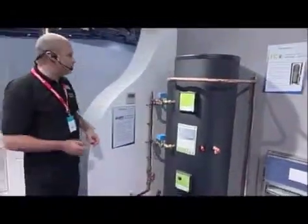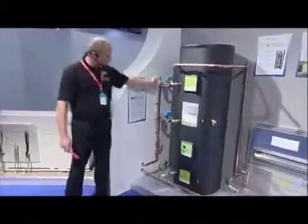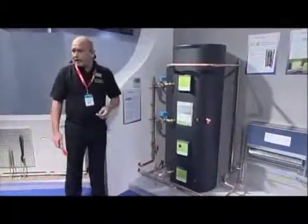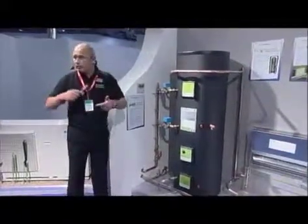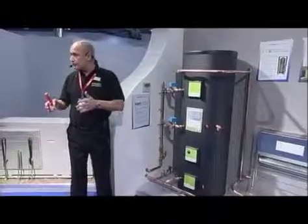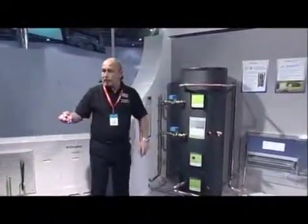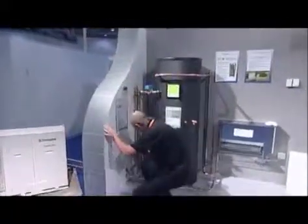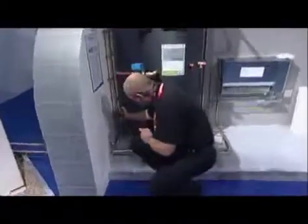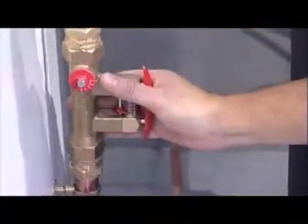In the past some plumbers have found the hydraulic design of the systems to be quite complex. This system uses a simple S-plan design through a wiring centre — nothing that a plumber won't have come across before. One of the other key points is flow: volumetric flow rate through the product is crucially important, because if we don't maintain the flow rate through the product, like a boiler it may trip out on overheat — a heat pump will protect itself and shut down. Within the package we have a flow meter so we can ensure we have the right volumetric flow through the product, which should alleviate any pressure faults within the system.